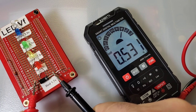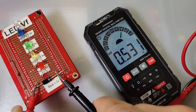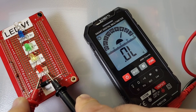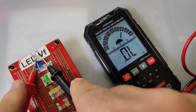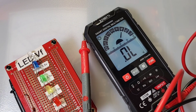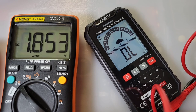Starting off with a standard diode — there's our forward voltage drop, looking good. However, we don't get that nice beep. Moving on to the red LED — it is not lit and we have no forward voltage drop. The red, the green, the blue, the white — it's not a piñata. Oh man — zero for five for LEDs. That explains it: a really dismal 1.8 volts output voltage in diode mode — not enough juice.